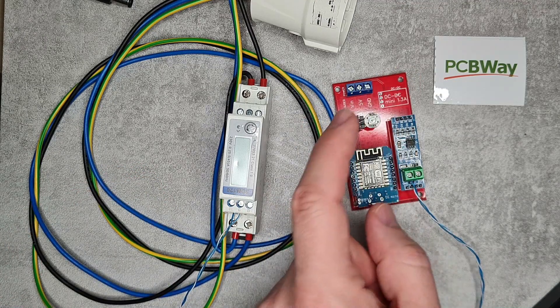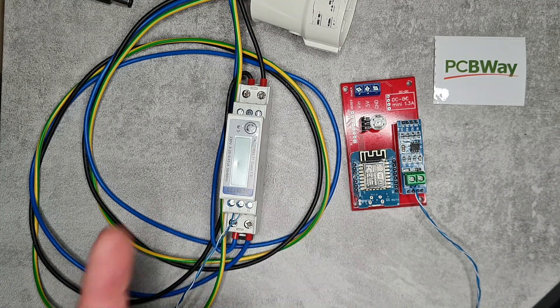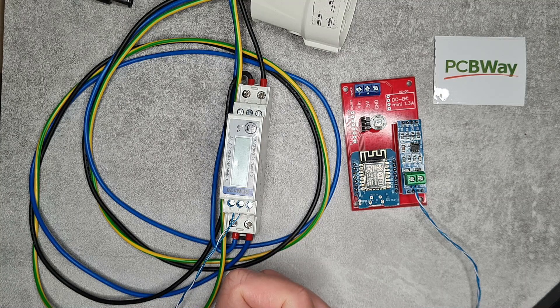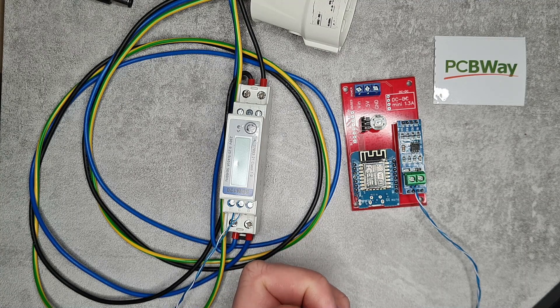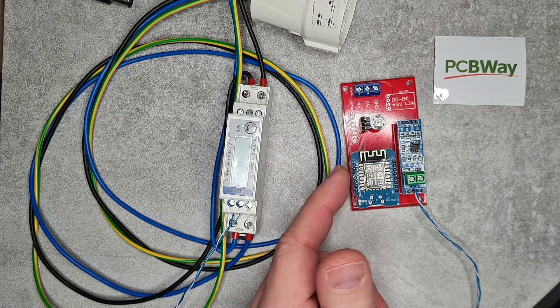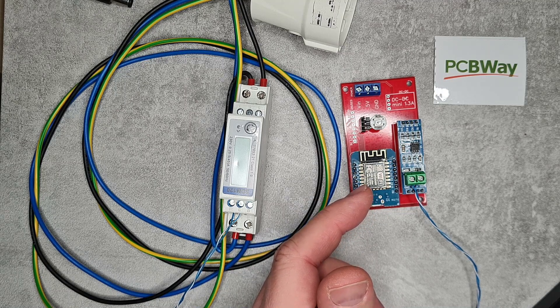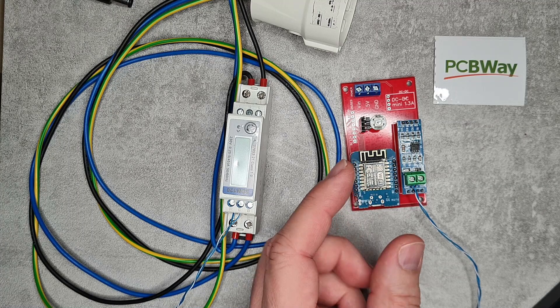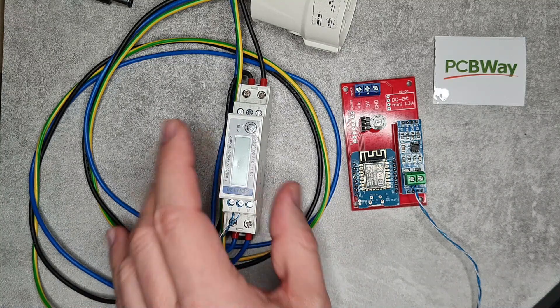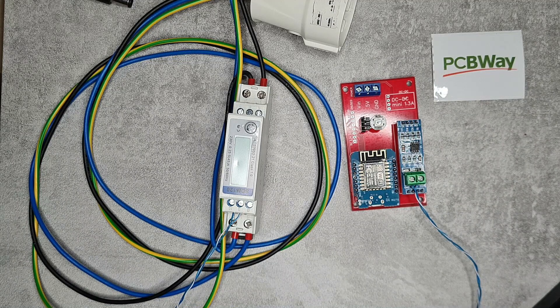This video is about the new sketch I wrote for this new board, which I designed specifically for this project. I'm going to talk about how the project works, how the code works, and how you can use it. Everything is going to be on GitHub. I've reused some of my earlier examples — converting Modbus data from a GrowWatt solar inverter to MQTT and a 16-channel current meter project. I've now expanded the code to include a web interface and a JSON HTTP output, so if you don't need MQTT you have other options as well.